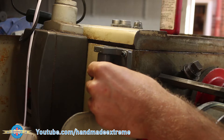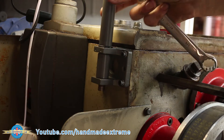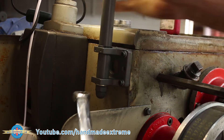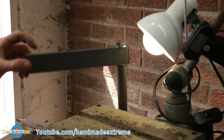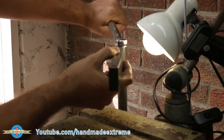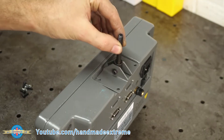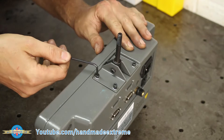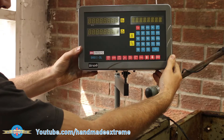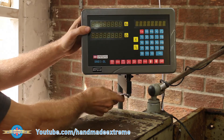The arm was then reassembled. There's a little spacer that goes in the bracket to stop it getting crushed, and then a lock nut that goes on the bottom. There's also a locking bolt on the top of the arm just to stop it from swinging around. On the bottom of the screen there's a little mounting plate which gets fastened down with some cap head screws. The DRO screen goes onto the arm and then just gets locked in place with a little nut on the bottom.